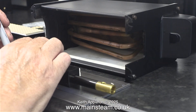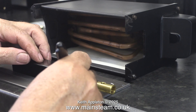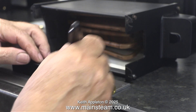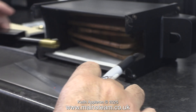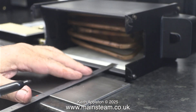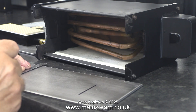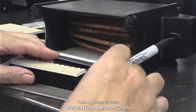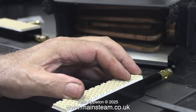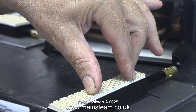Here I am just experimenting. This Bix burner has a longer than normal venturi tube, which means that the primary air inlet holes will be outside the boiler casing. I think this is the best method, having them outside the boiler casing because there is less CO2 — carbon dioxide — outside. I don't want the venturi tubes in a carbon dioxide environment. Also, if the venturi is inside the casing, the venturi holes could catch fire because there is gas in a venturi, and ideally this needs keeping away from the burner's heat source.